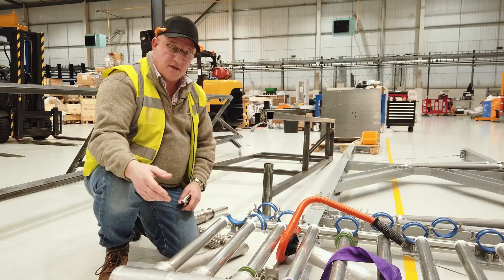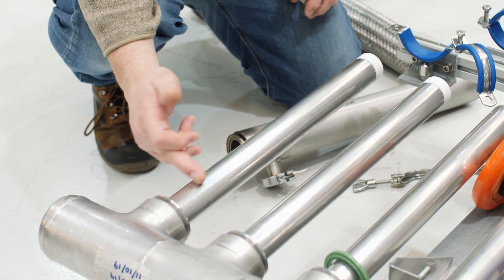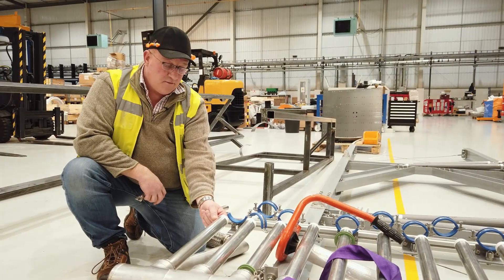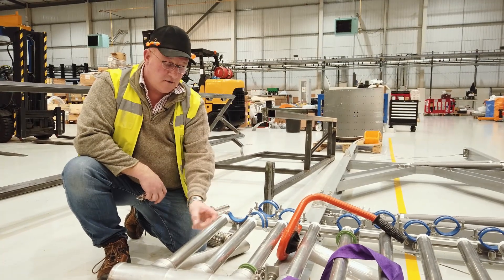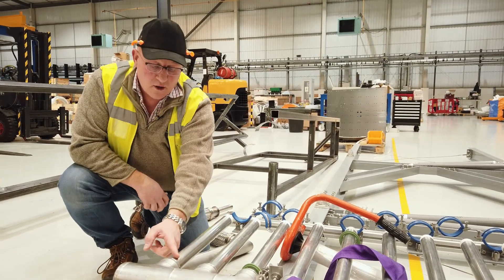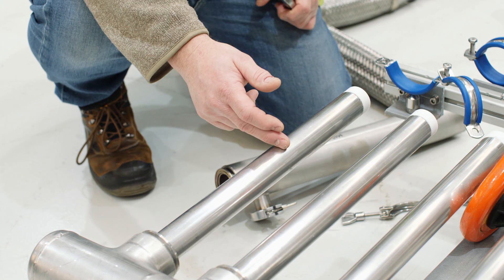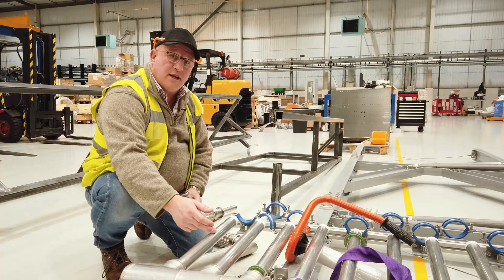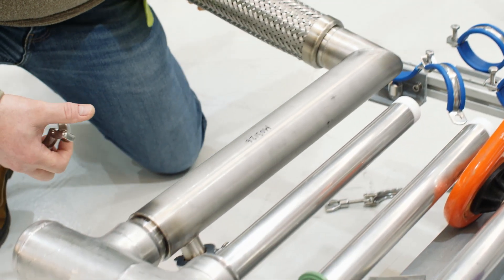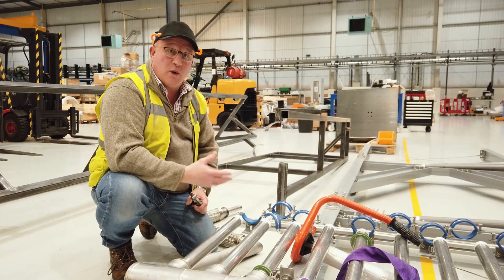What we have here is a manifold. And the way it works is very much like a thermos flask. So we have an outer tube, and then we have an inner tube on the inside here. And between the two tubes is a vacuum. Now this vacuum insulates the liquid from the outer tube. The outer tube is a very long tube, and in order for any hot energy to get in, it would have to go along this very thin tube — and it's not capable of doing that. The thinner the metal, the more efficient it is. This is called the bayonet. And we use it on ST40 as an effective way of connecting pipes quickly, safely and making sure that there's no residual liquid left when we need to dismantle the system.